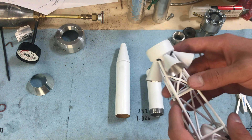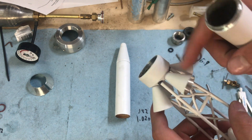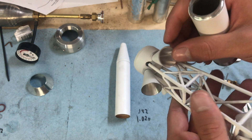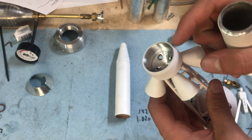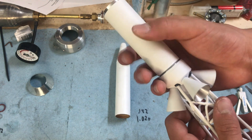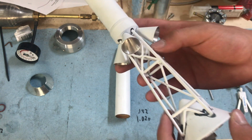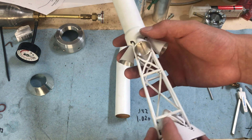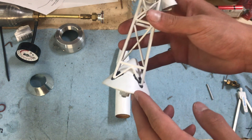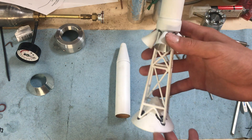Most impressively, in my opinion, is the actual launch escape rocket. This part here, including this part, is all machined out of aluminum. These four nozzles, also made out of aluminum, thread into this little bulkhead here, and then the whole thing screws together just like that. Attached to the bottom of that I've got a truss structure which I welded up out of some cold rolled steel and some TIG filler wire.